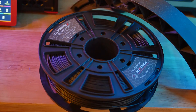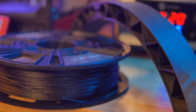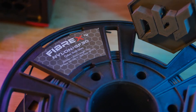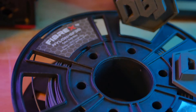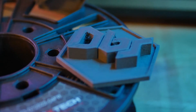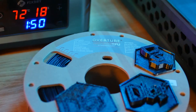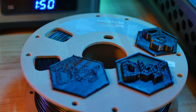The polycarbonate that I really love to print is maybe a bit more sensitive than PLA, but still not too bad. Nylon, however, is super bad — one of the worst filaments for moisture sensitivity. It definitely needs to be kept dry and dried before and during use if possible. TPU also seems to be sensitive, but I don't print it very often so my experience there is limited.